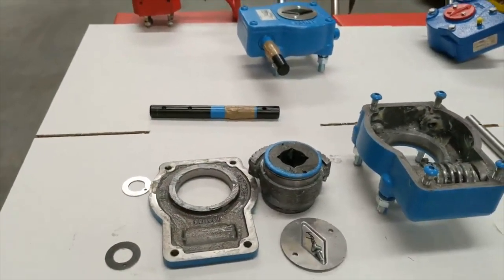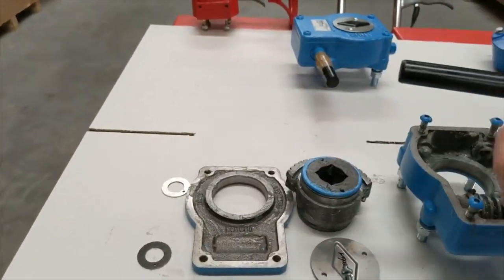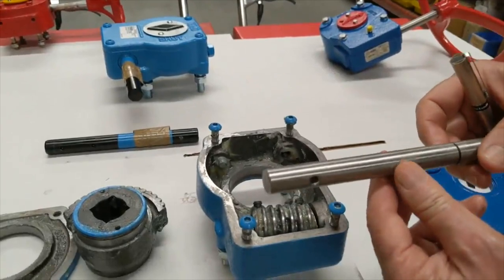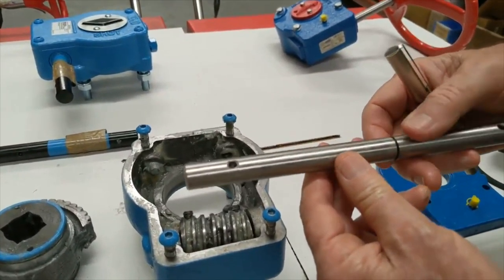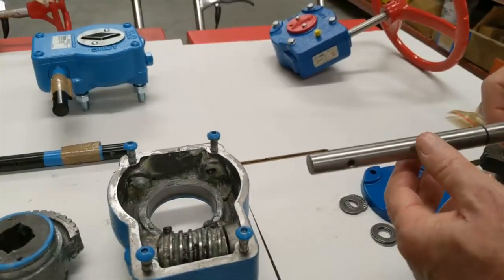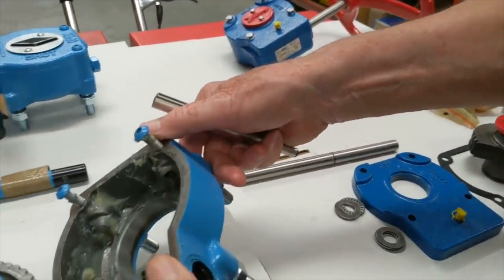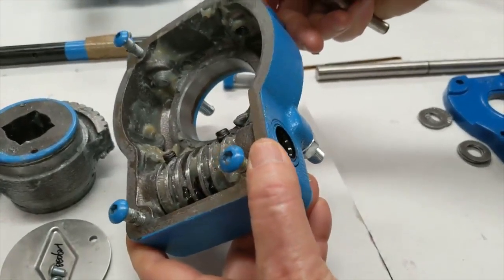Both shafts may look similar but the Rotorq shaft is a rolled and painted steel shaft, whereas the Process Systems 316 stainless steel shaft is centreless ground, giving a much smoother surface for a better seal. Regarding greasing: the o-ring on the Process Systems shaft is fine with grease. It's actually an advantage because over-pressurised grease can bypass o-ring lip seals. On the Rotorq, there's no grease nipple, so pressure could build up if you try to grease it.